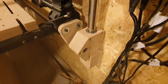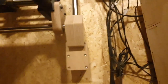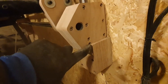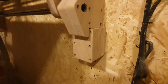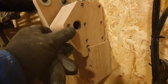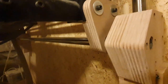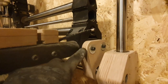Thanks to this new setup, which looks quite chunky and horrible, but it's really, really rigid — a really good way of doing it. This bit here locks over this block, which is screwed into the wall and is perfectly level with the block on the other side. When it pushes against that, it stops any flexion. And this stainless steel polished tube goes right through onto these bearing carriers that are then screwed in at the edge of the table.